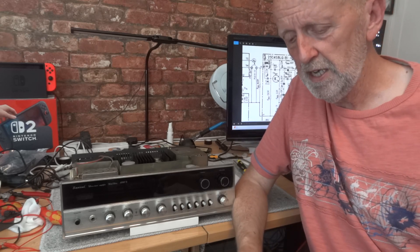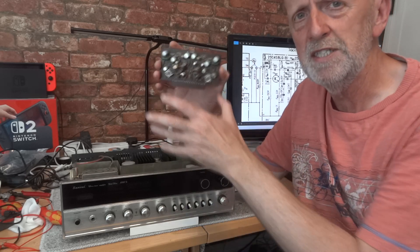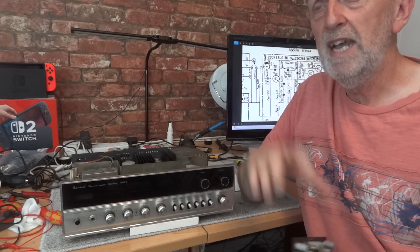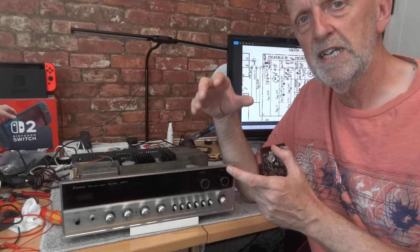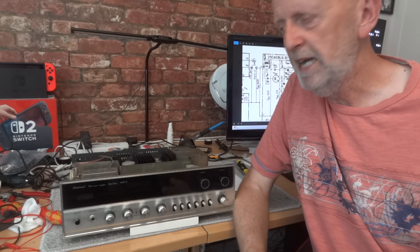The main point of this video is that on this board, just changing two transistors - nothing else - and comparing two replacements: the 2SC1815 versus the KSC1845, which are both common substitutes. In my case the 1815 was the better choice - it brought that bass back. And that's the conclusion.